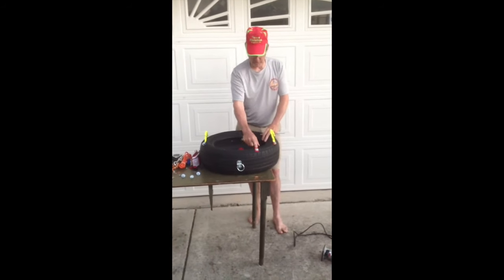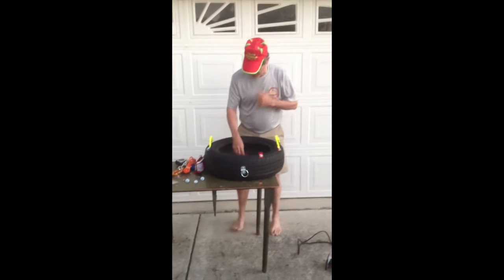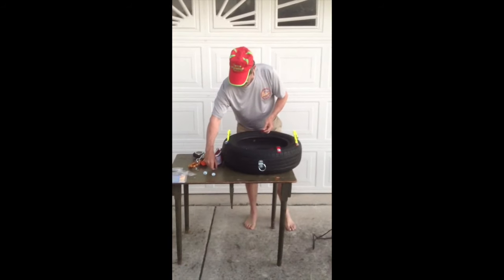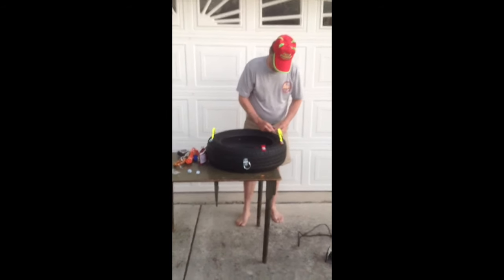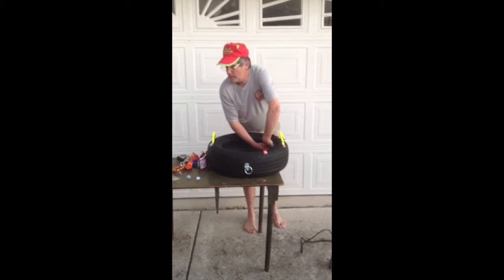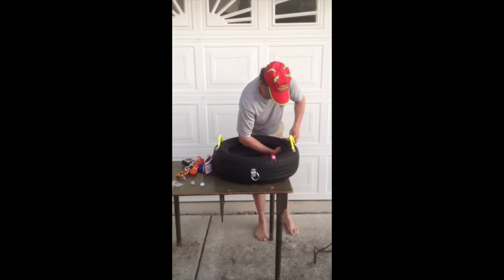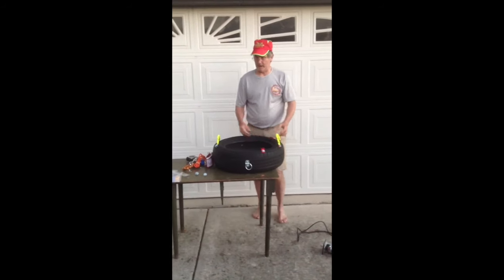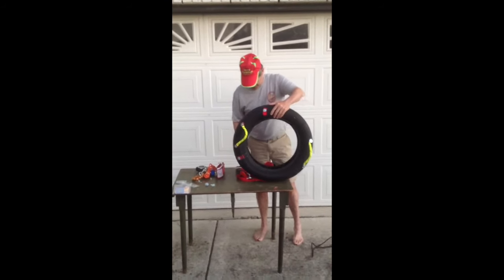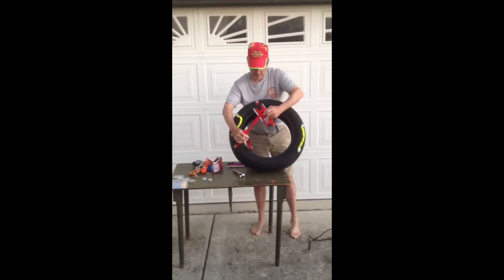So the shoulder strap that's up by the head needs to be straight up and down, not at an angle. However, when you put the clip on at the bottom, same thing, I take the nut and bolt with the small washer and put it through the hole. I'll put the big washer underneath, then the nut. I'll tighten this one down, and when I do that, this one is straight up and down, and this one's more at a 45-degree angle. The reason for that is so when you put the straps on, this follows the angle of the strap itself.